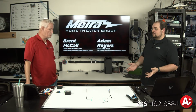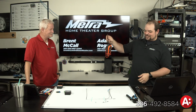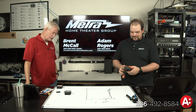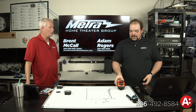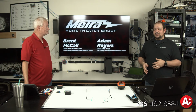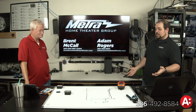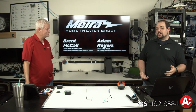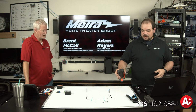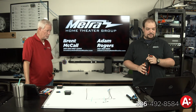And don't forget your voltmeter. Please have a voltmeter. See, I brought it out just for that, because we're going to ask, hey, go get your voltmeter, and oh, I don't have one. Honestly, even if you think it's not necessary for the type of job you're on, there are things we can do with a voltmeter that don't just test whether you're getting 12 volts. We can test for continuity and other things like that. So definitely bring a voltmeter with you, and make sure it's charged and has good batteries.